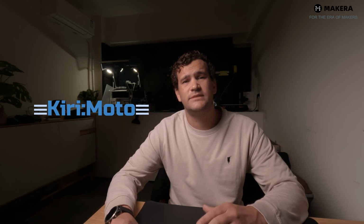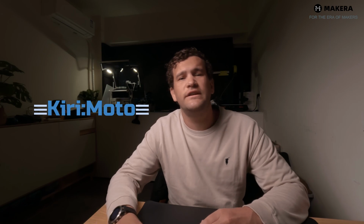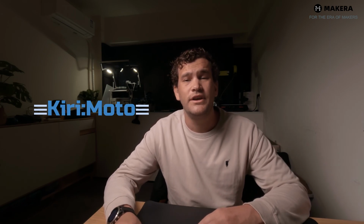At the moment, the 4th axis model consists of only indexed milling, which does each side separately, but I do believe that there will be many updates to the software, as the developer is very active on the development channels and offers great support and overall knowledge to the CAM community. I think this software is a great solution for beginners that are not quite ready to invest in a professional CAM package. And like I said, I'll be making the same part in all 3 softwares, so you can be the judge. So let's go into a bit more detail in each of these softwares and create the Gcode for this part. We'll start with Fusion.